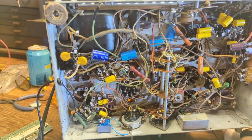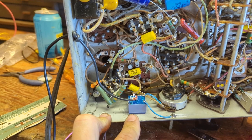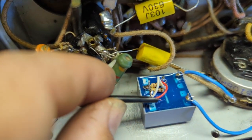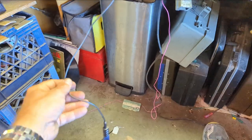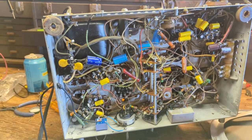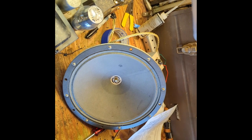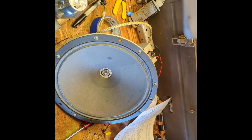I've installed the audio input feature. This goes through an isolation transformer which will also help boost our audio a little bit. One side goes to chassis ground, the other goes to the top of the volume pot, and then we have a set of resistors underneath that tie the right and left channels together for true mono — that goes out and connects to our Bluetooth receiver. When you plug the audio in, the radio is automatically shunted, and it automatically returns when you unplug — it's automatic.